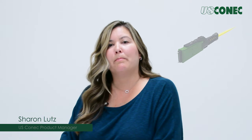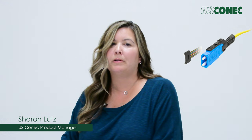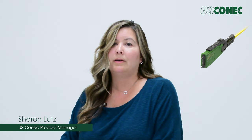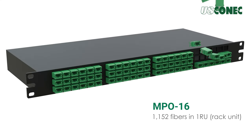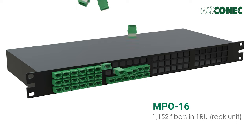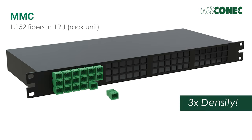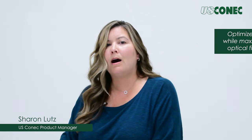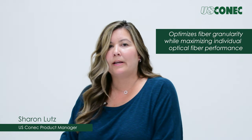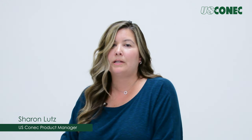The MMC connector embodiment takes full advantage of the TMT design by incorporating the small ferrule into a very small form factor, evolving from the MDC connector format. The MMC connector with TMT ferrule further increases fiber density at the connector module or transceiver interface by as much as 3 times over standard MPO connectors. The very small form factor connector embodiment optimizes fiber granularity while maximizing individual optical fiber performance versus other multi-fiber connectors.